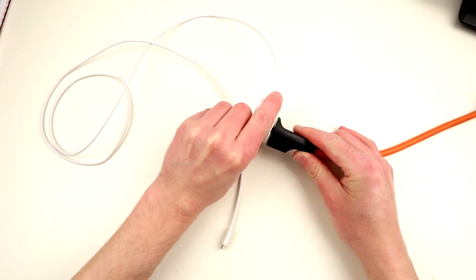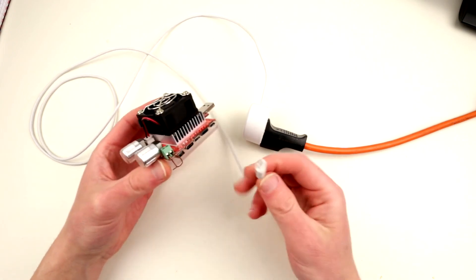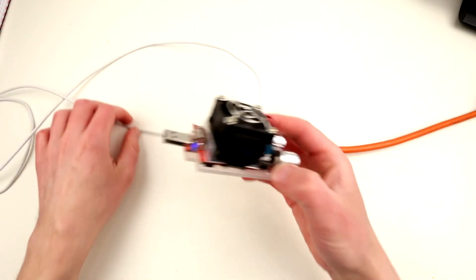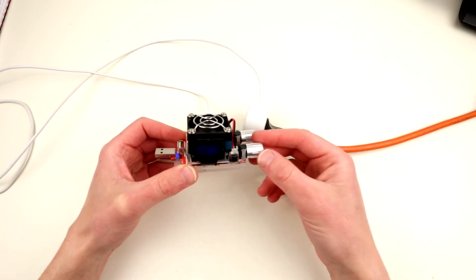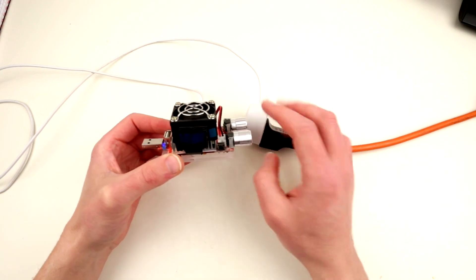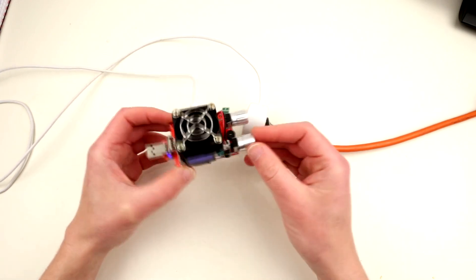Looks like there are no sparks. I have my favorite power bank tester — it can also test micro USB. Let's see what happens. Something is happening — 5.06 volts. To test whether it's functioning to its capacity, let's crank up the current: 1.8 amps, 2 amps at 5.2 volts — that's pretty decent. Let's go up: 2.3, 2.4, 2.5 — wow, doing well — 2.6, 2.7 amps, then shutdown. So this thing can put out roughly 2.7 amps.